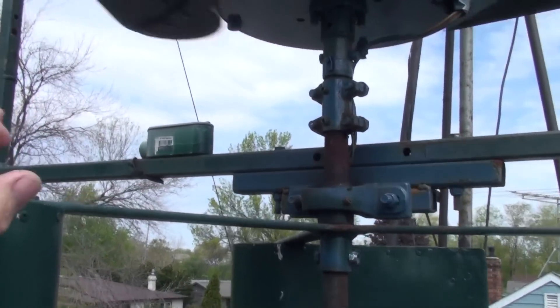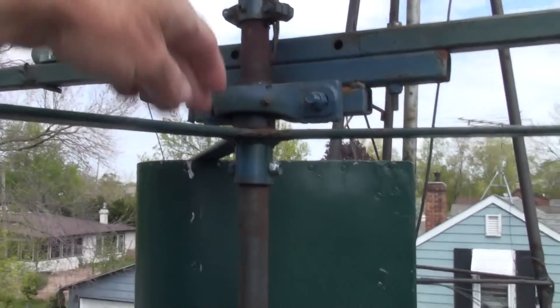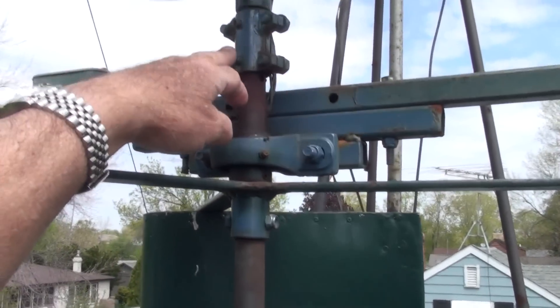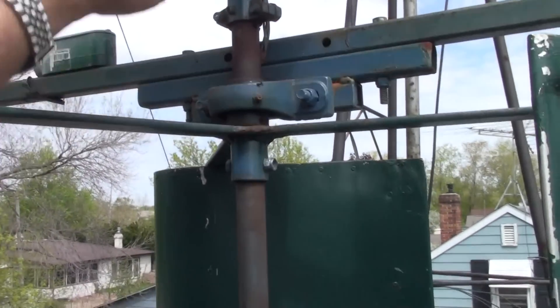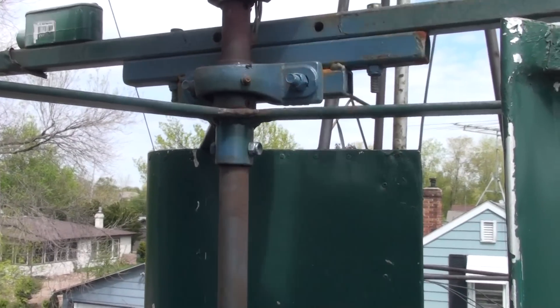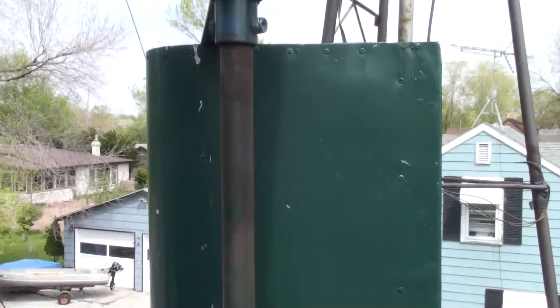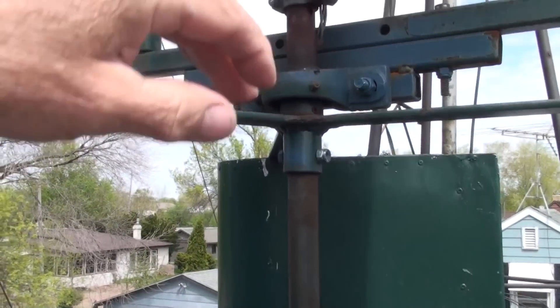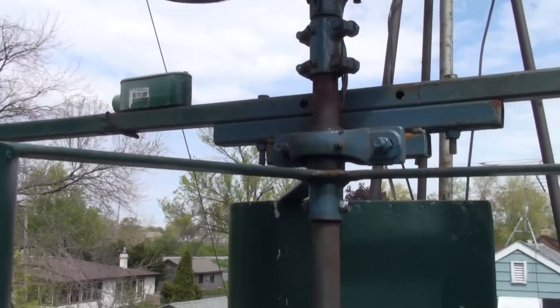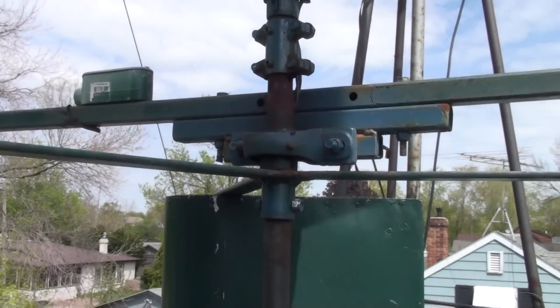This one's counter rotating, so I've got this in the middle, but this could be on the bottom or the top. I made a coupling out of a piece of pipe, but you wouldn't have to do that — you'd have a hub on your alternator, on the discs, that would just be pinned through the shaft with a hole and attached just above here. I'm going to go out to the one on the dock and show you that in the next video, because that'll be easier to understand.